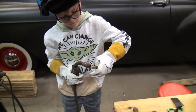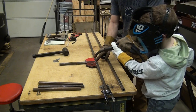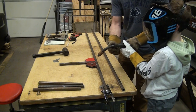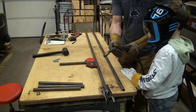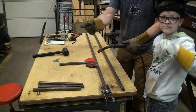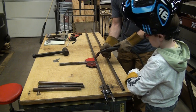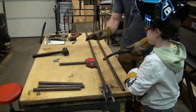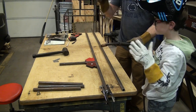Blake's going to cut the wire, sticking out just a little bit. We're going to go right in between the two joints and give it a couple of little zaps. When you're welding and you want to practice and get better, you want to actually roll it — do real small circles — and that gives you a nice clean weld across it. This welder is smart enough that you could just start to zap it and go right in a little line and still get a decent weld. But as you practice, you want to do little circles.